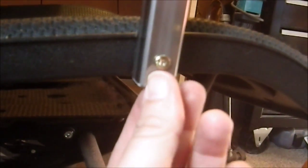Here's the new support. I didn't pre-drill because this is a self-tapping screw designed for wood — I just treated the plastic like super-dense wood and it worked really well. It's a nice snug fit. It isn't perfectly flush, but the tubing wall thickness is only so thick, so that's as flush as it gets. It's centered, which is what I wanted, and it's sitting at the right support level. I put the sleeve on already to save myself untying and retying it later. I'm thinking I may want to use some kind of chemical bond — maybe some Sugru, which bonds well between different materials.